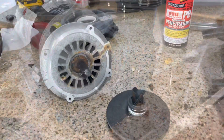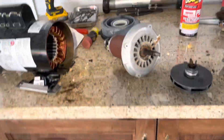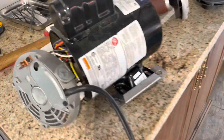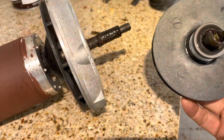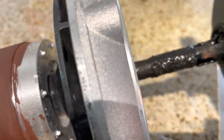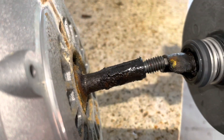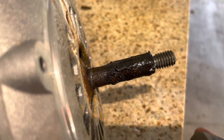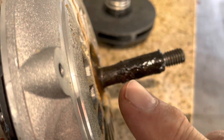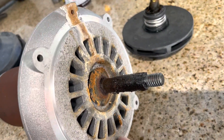Things got out of hand — I could not get this impeller freed up. It was just on there too tight. The impeller screws on clockwise, regular threads, not reverse thread, but just all the corrosion from over the years. I'm fortunate the bearings feel good in there though.